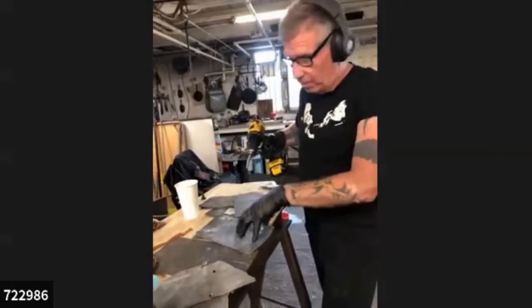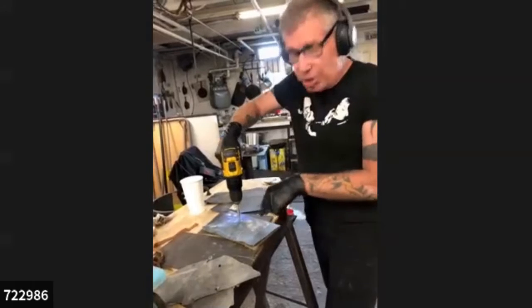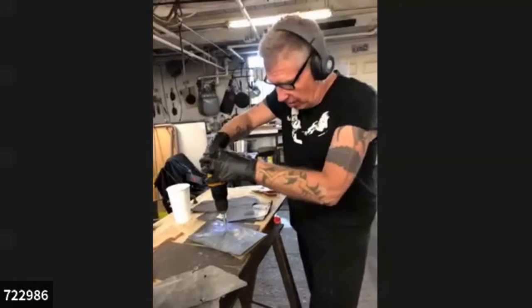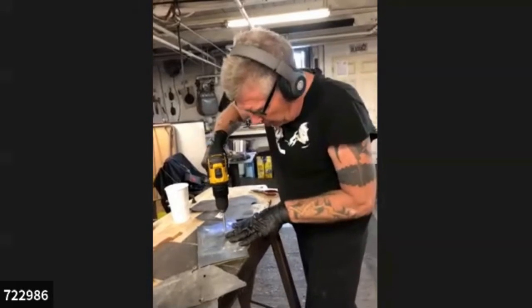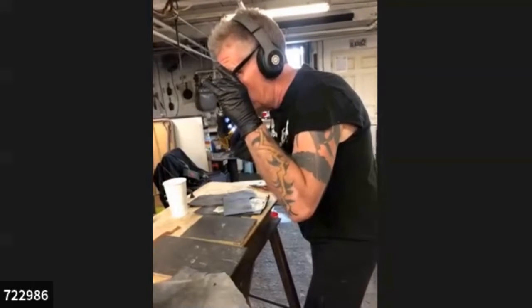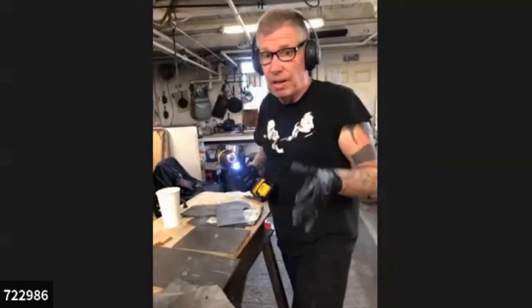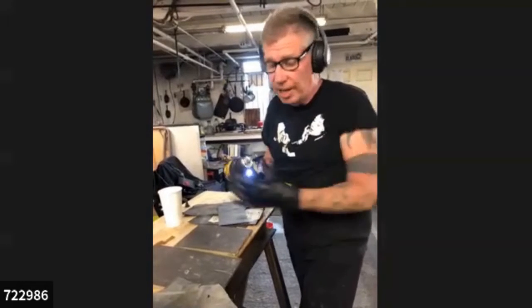I'm going to take that 220 grit, 120 grit, and if I push it down into the rubber, the edges of the hole it's trying to create are going to sand down the edge of this. Yep. It took a little bit. It rounded the edge slightly. That slightly, again, is just enough to not rip the metal as you're working it, to create a design.